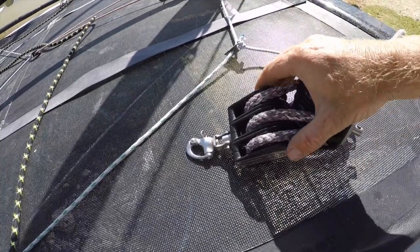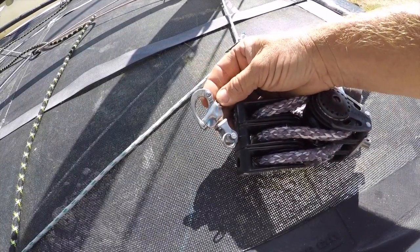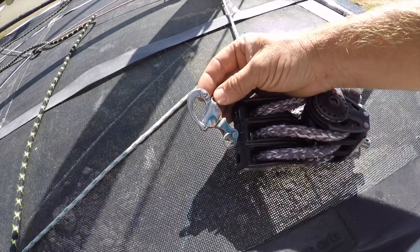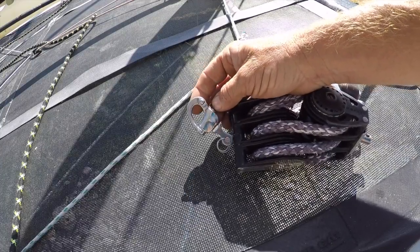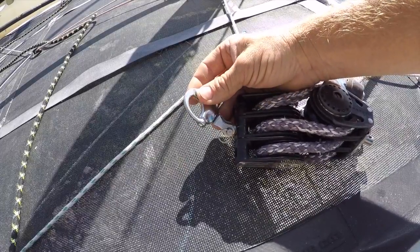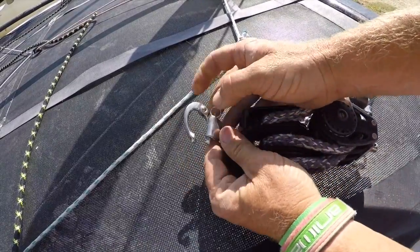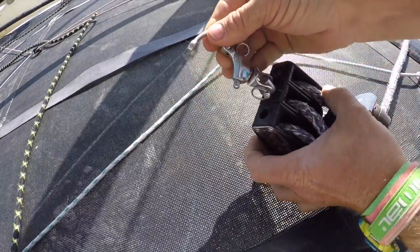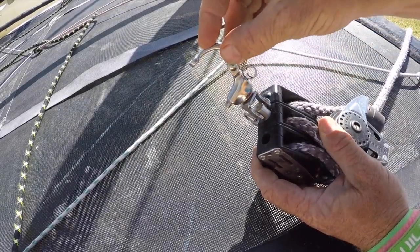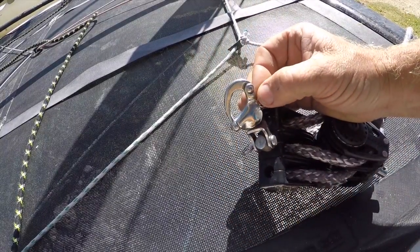So this is the final tip for this video. You can replace the shackle on your top mainsheet block with a snap shackle like this, and this makes it super quick to release your mainsheet. If you should ever need to release your mainsheet — like when you're rigging or derigging the boat, coming into the slipway, or if you just need to release your mainsheet from the boom — all you do is pull this part, that releases it, and there we go. We use these all the time on all of our catamarans at Wild Wind, so there's absolutely no question whether they're strong enough. We've never had one break and they're so quick and easy to use.